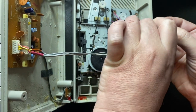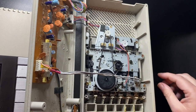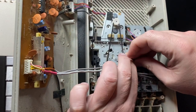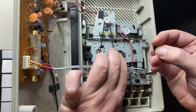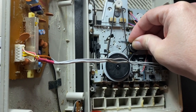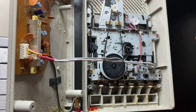The purpose of the spring is to cause some tension which allows the mechanism to work properly. These two belts feed off each other, and if this isn't set up properly nothing works. You're going to need to super glue the bottom of the spring onto the top of this plastic part, press it down, and if you've got a cap like mine which is cracked or loose, you're going to need to super glue the cap in place so it doesn't pop off again.